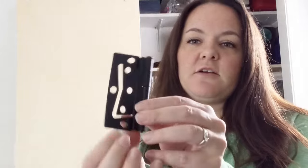To make this project as easy as possible, I'm using non-mortise hinges to hang my closet doors. With traditional hinges you have to chisel out wood from your door and door jamb everywhere you place a hinge, but non-mortise hinges fit together into one slim package so you skip the chiseling entirely. Just be sure your door isn't too heavy for them — they can hold a surprising amount, and with three hinges per door you'll probably be fine, but check the weight limits.